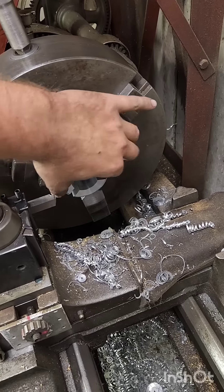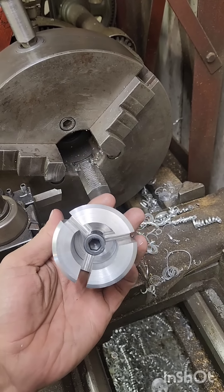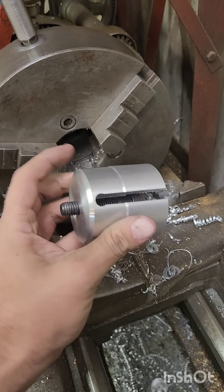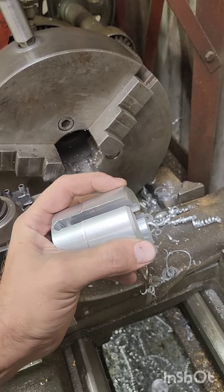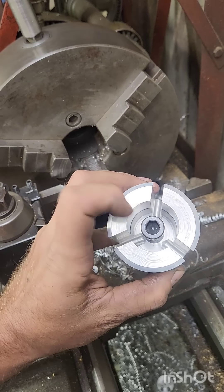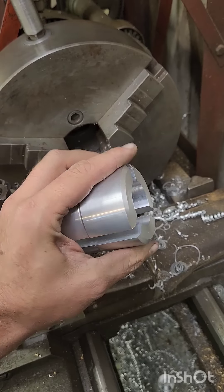It's held in there just by spring pressure. It's just simple aluminum with a backstop. There's a little collet relief right there, so it's squeezing down right here, and you just treat it like an emergency collet. You bore it to fit about ten thousandths over the job size you need to grab.